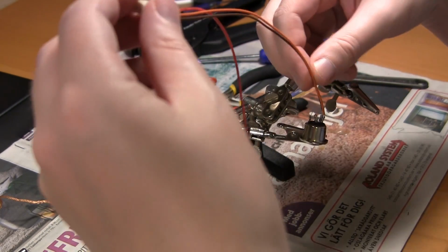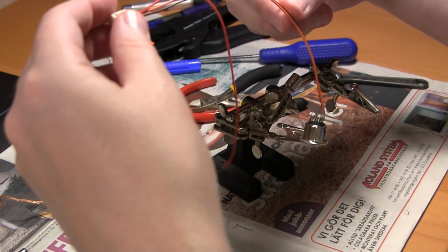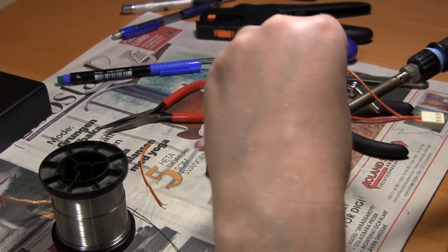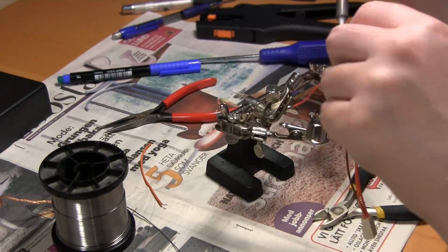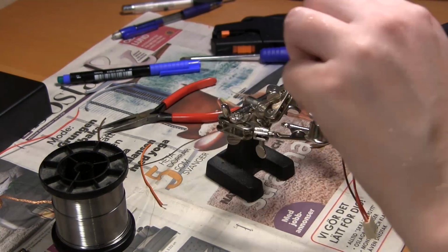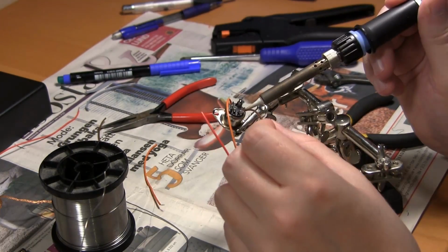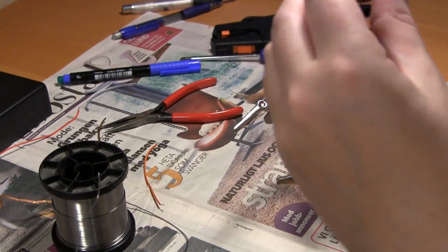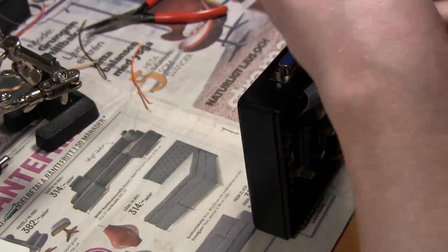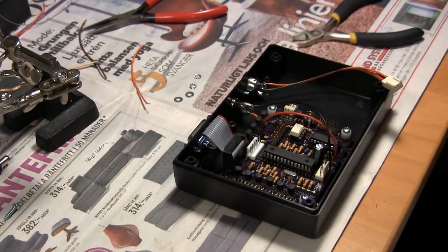And next up is the MIDI connector. Nothing exciting going on here really. Sorry. Just cutting away one of the cables. I was thinking of using some sort of shield internally. I know you shouldn't connect a MIDI input shield, but you could still shield the actual wire on the inside as long as it doesn't connect to the cable shield.